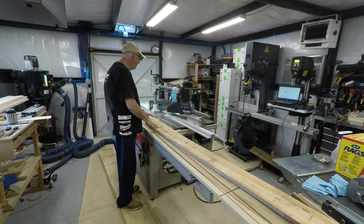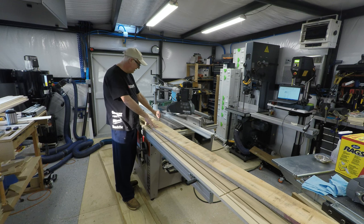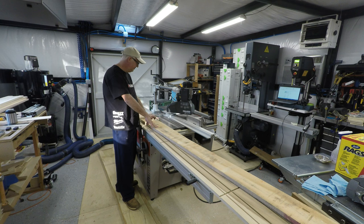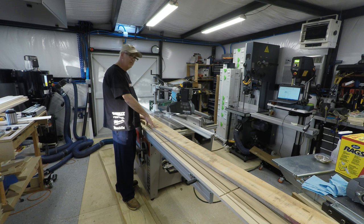What I have here is a 315 millimeter Felder ripping commercial blade, and it basically has 12 inches. That's basically what I use to rip wood and run edges. I've run this a few times. The thing I've noticed about this blade — there's not a whole lot of burnt wood on it, but it's a pretty loud blade. It's got these air gaps but it's real loud, makes a lot of air noise.